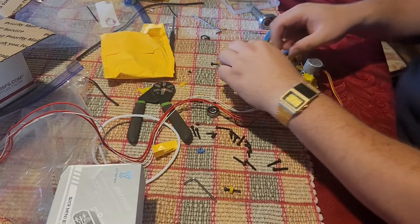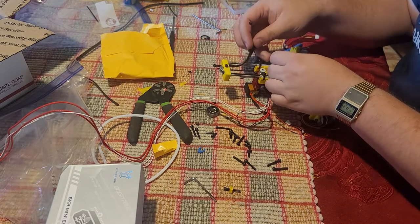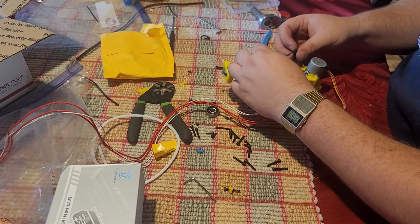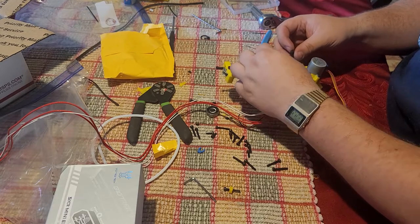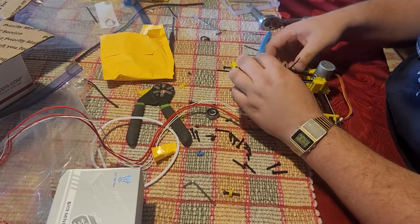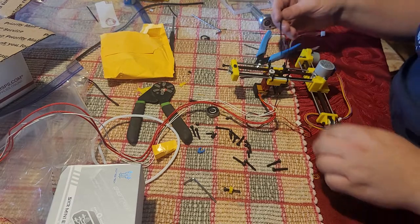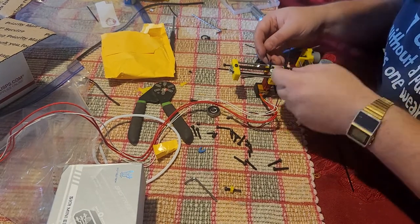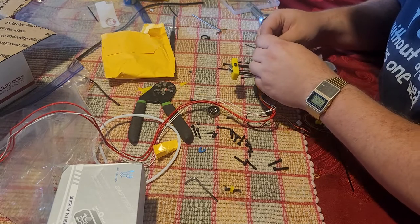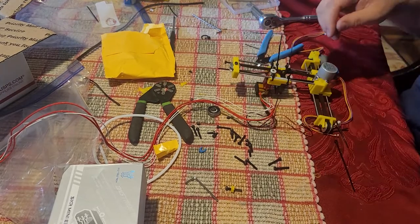And now, I'm going to take these two, feed a zip tie through them, to get the belt nice and tight. And again, I like leaving some tail on this so we could tighten it in the future. Tuck it down in there. And take some zip ties and feed it through the sections here with the blocks. The blocks are in there so that you can get the belt nice and tight without affecting the PTFE slider tolerances, so that it won't bind on the PTFE belt.